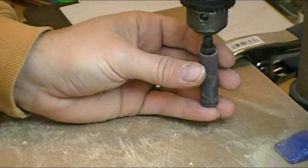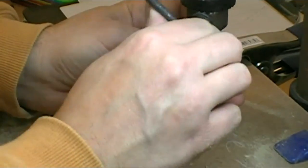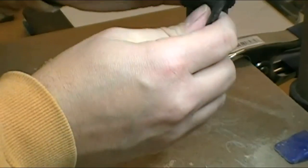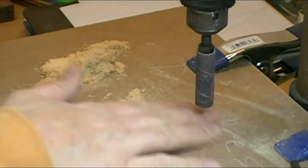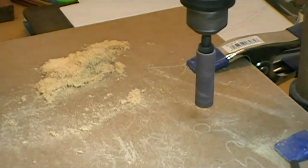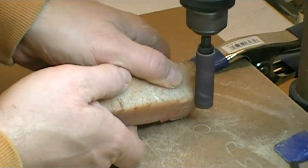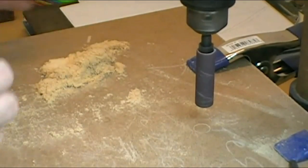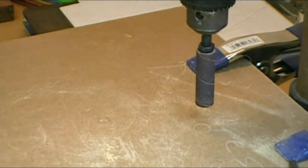In order to put this on, I go all the way up. And then I bring it down about a 16th or an 1/8 of an inch, and then I tighten. I go until I get finger tight here so it holds. Over the next one, tighten a 16th of a turn, 16th of a turn, 16th of a turn. This way all three parts of the chuck grab that spindle rod evenly. I turn this on, I'm just looking for if there's really bad wobbling effect happening. I'm going to clean this off in case there's any residual sawdust that I don't want on there. Good. All right. I'm going to get rid of all this pretty much poplar dust here. Put that in the garbage.